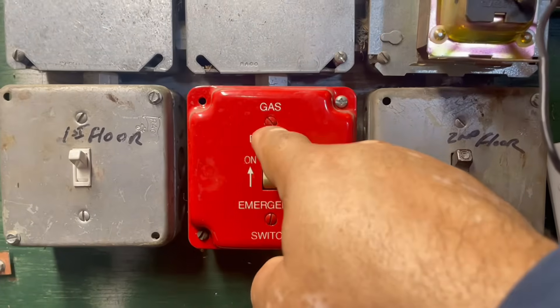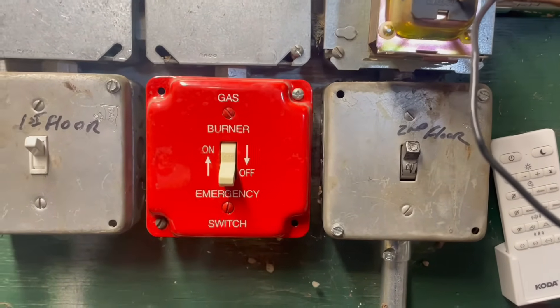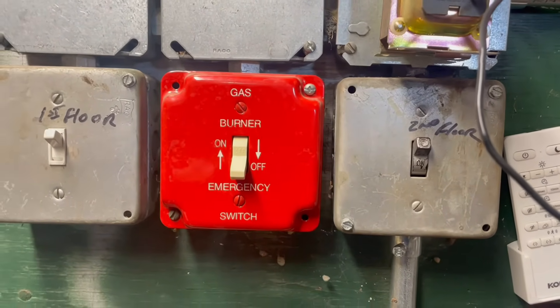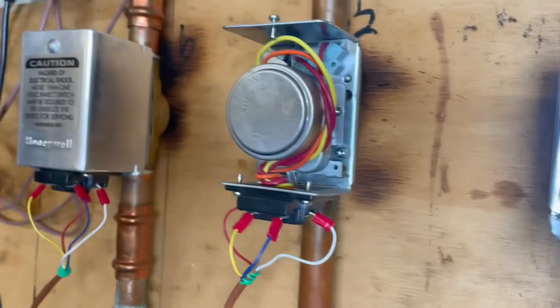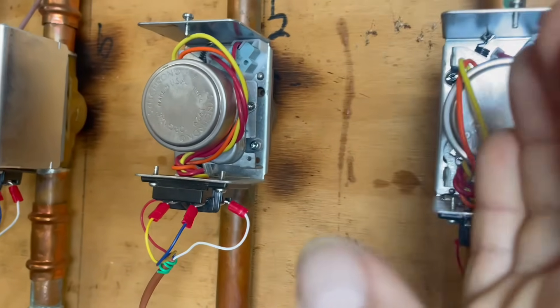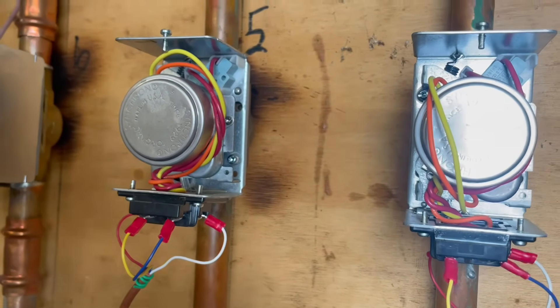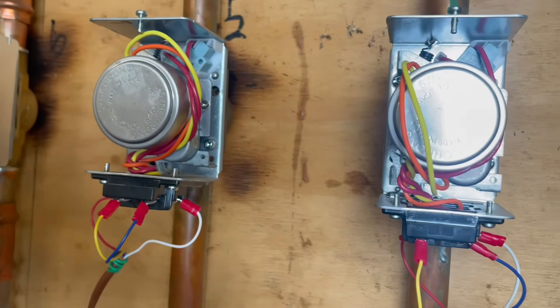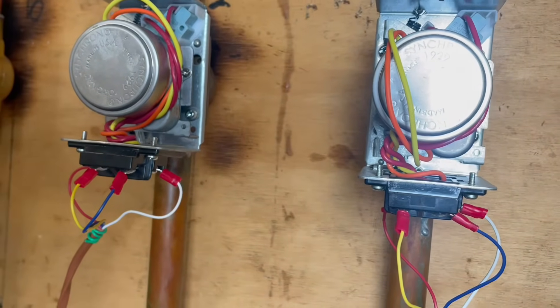Let's turn the heat off, the boiler off, just in case some wires touch other wires and you make a short. When you turn the power off, all the valves return to their original position — the off position — because they are all spring loaded. So they come back to the off position when you turn the power off.